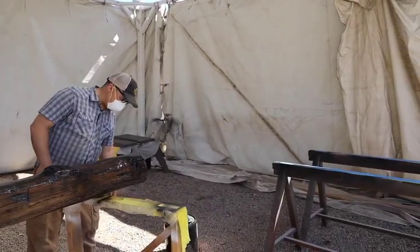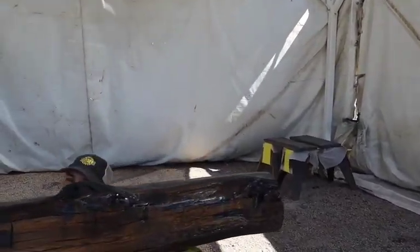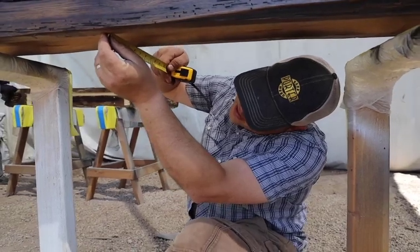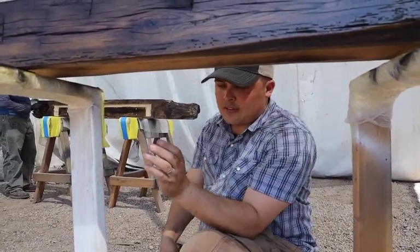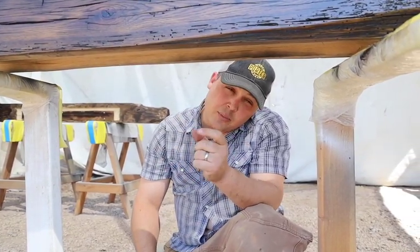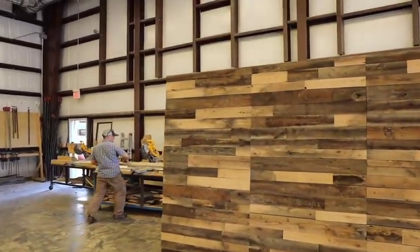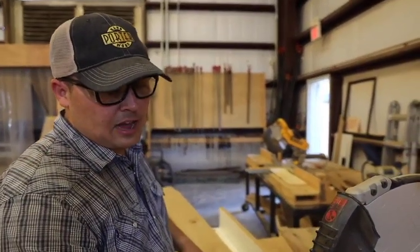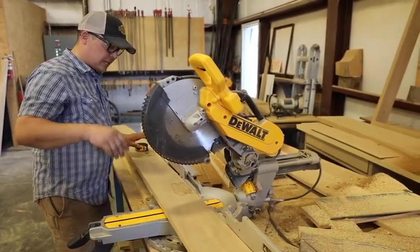I'm going to measure it up and we are going to move in there and start building a French cleat. This French cleat pocket right here is about 3.5 inches, which is smaller than I usually like to make them. So I've got to make sure I have enough room to put the French cleat in, set it in, and let it move up. That's a really tight space, so we're going to make a couple of small French cleats out of something really hard so it's nice and strong. I'm going to take this piece of white oak — it's really strong — and mill this down to 3.25 inches, then start making our French cleat material. I've got about 45 inches of space and 3.5 inches vertical, so I'm going to cut this somewhere real close to 45 inches. I don't need to be super exacting on the chop saw here. Then I'm going to plane this down to 3.25 inches and head over to the jointer to joint one edge.